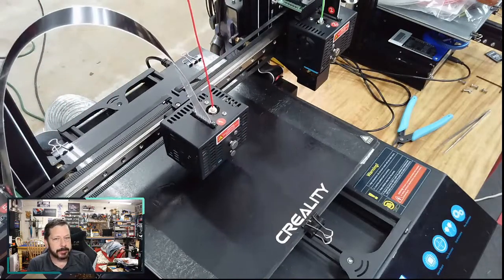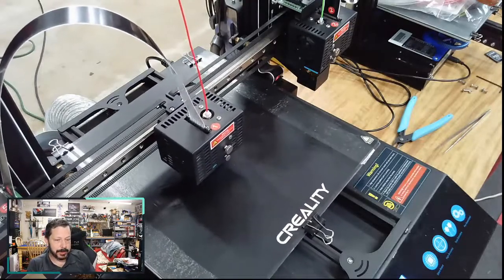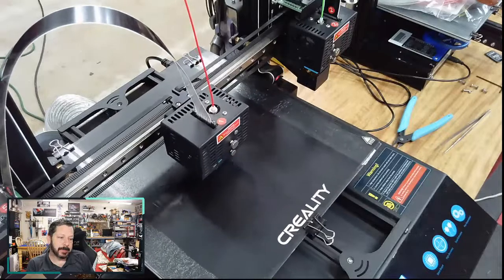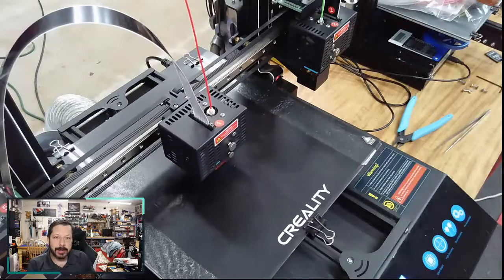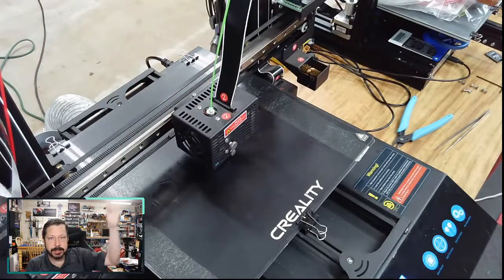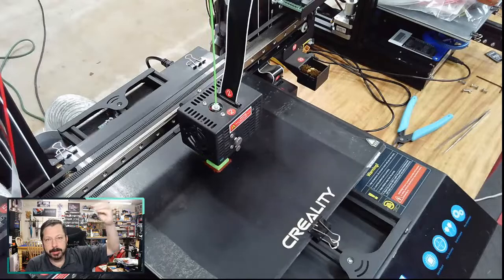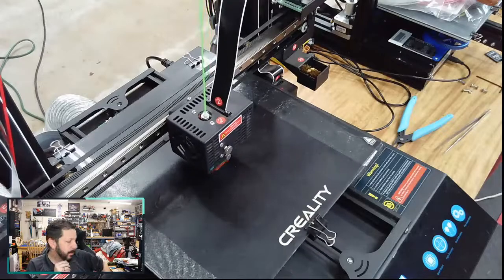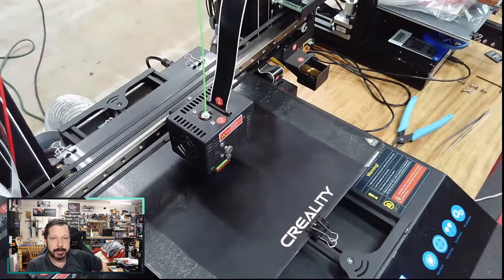Both of these can be finicky to tune. For the process to work, you have to have the right color coming out of the nozzle at the right time. And so there are some use cases where they just don't work very well. Maybe you're printing really tiny things, and it just doesn't work that well. But they both do that type of thing. The Prusa one does not weld the filament together. It sends the right color and then chops it off and sends another color right behind it without welding them together. So there is a little bit of pause between each color change, whereas on the Mosaic, assuming it buffers far enough ahead of time, it can usually just keep up without having to pause your print.